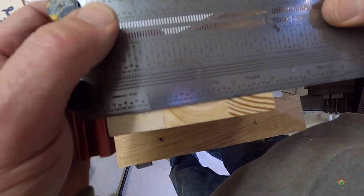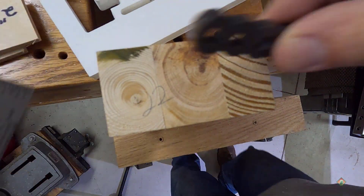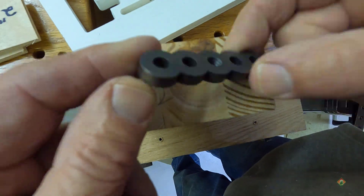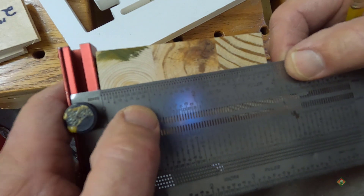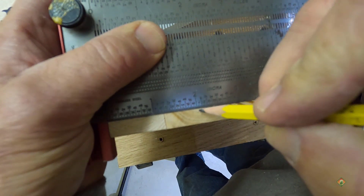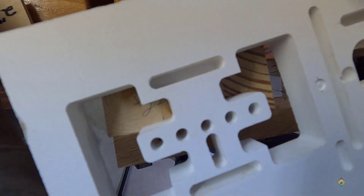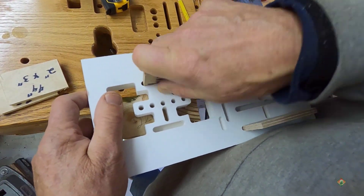When routering the ends to make a tenon, most of the time I mount one of my fabricated tenons — these are made of steel, quarter-inch thick, with a threaded hole in the middle. I actually have a US patent on those; if you're interested, get in contact with me. But if we want to make a routed tenon, I'll use the template to get most of it done. I need to make a mark and use the guides on the two sides — the quarter-inch ones — to control the width.